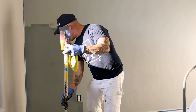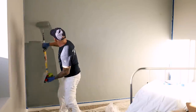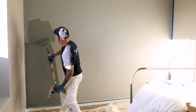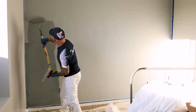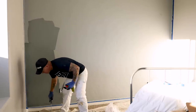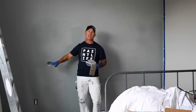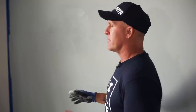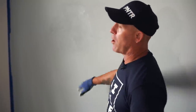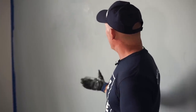Getting close to finishing the second coat. Now I'm on my third coat, and the third coat is applied just like your first and second coats. You're going to have to work fairly quick because the coating sucks up the moisture out of your product really fast. I've got my three coats on — I did three coats yesterday and let it dry overnight. To do any type of polishing, burnishing, or sanding, you have to wait at least two hours and no more than 24 hours.